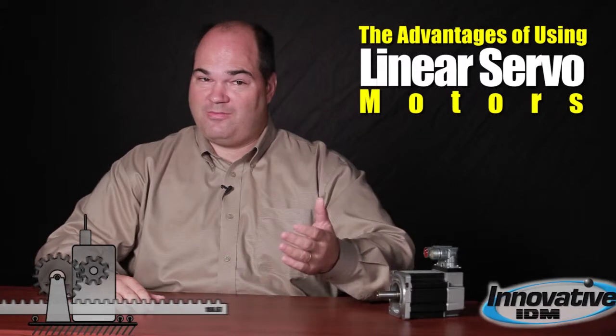A lot of people have never even heard of a linear motor and don't know what that is. A linear motor is the same thing as a rotary motor that's cut and unrolled. There are as many types of linear motors as there are rotary motors. The physics are the same — just the mechanical arrangement of the parts is a little different.